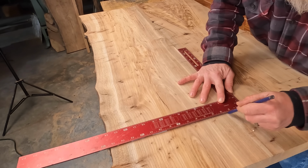Now I've got some checking and some imperfections in the bottom side of the table here. I'm going to try something new. I'm going to fill them with epoxy, but instead of using a liquid dye as I have in the past, I'm going to use powdered graphite. From what I hear, this won't pull into the wood. If the epoxy soaks into the wood, it won't take the graphite with it as it does with the liquid dye. It'll end up staining black around your imperfections.